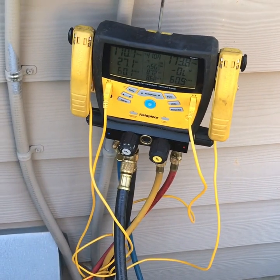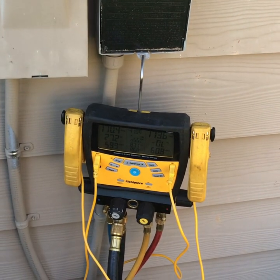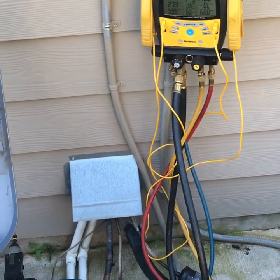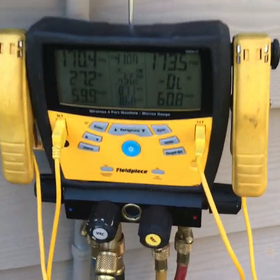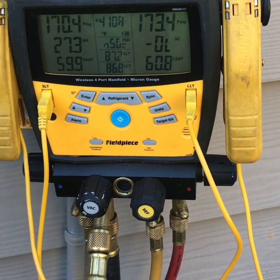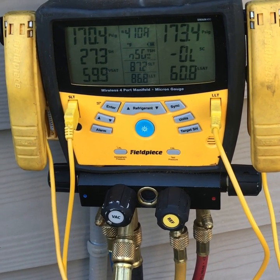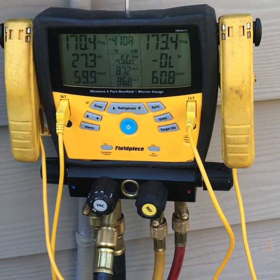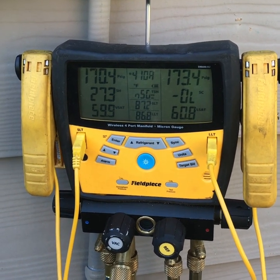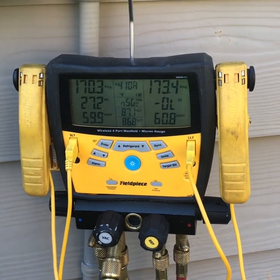A tip whenever you're adding nitrogen to find a leak: you always want to put about 200-250 psi at the most. There have been a couple instances where I've put about 400-450 in them and it can actually clog a tiny leak with all that pressure and it won't show up. So make sure you're around 200 psi when you do this to be safe. Let it sit at 200, and if it's still not showing a leak then you can add a little more, but starting out make sure you're at about 200.